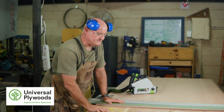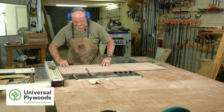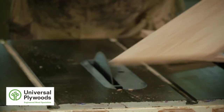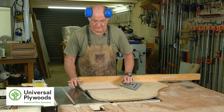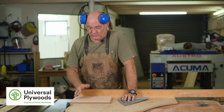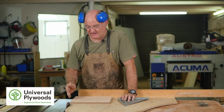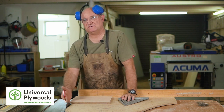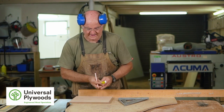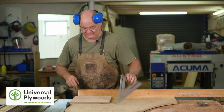We've cut out two pieces of plywood to start working with. We're going to cut those to a square shape now. We are ready to cut the top section of our iPad stand. We want our angle to be about 10 degrees, so I'm going to set my blade to 10 degrees. I'm going to go in 200 mils or 20 centimeters from one end and the same from the other end. These are approximate measurements just to give us some sort of idea.